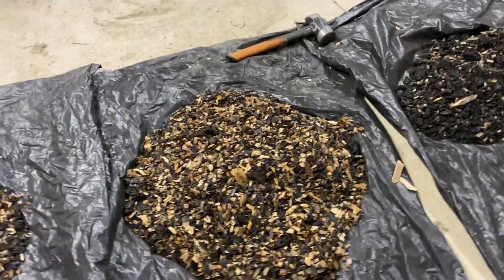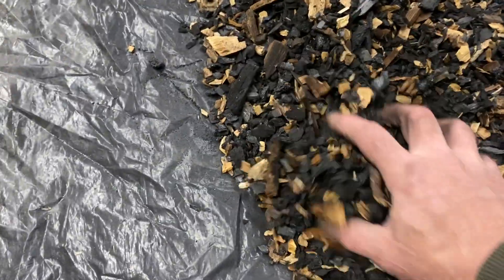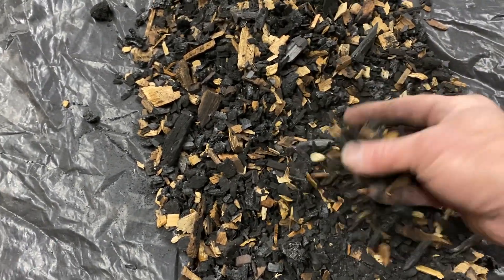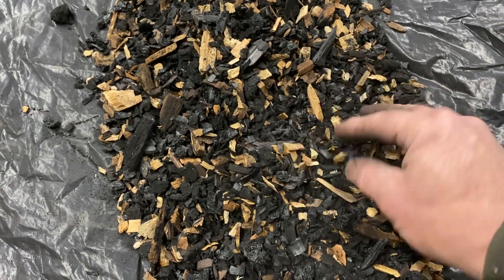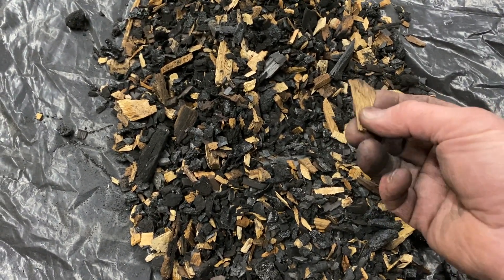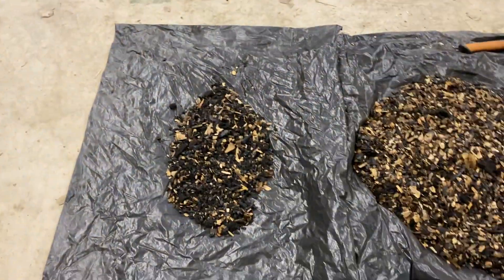This is material that was left in the combustion chamber. You can see it's about half charcoal and half tar and wood that hadn't yet been consumed — that's exactly what I'd expect to see. The fifth pile was what was in the reduction zone down here.